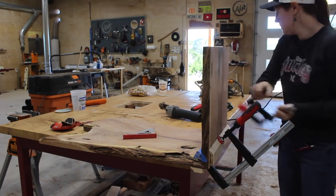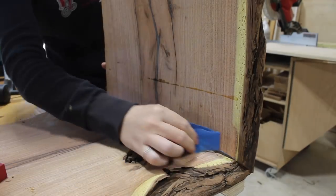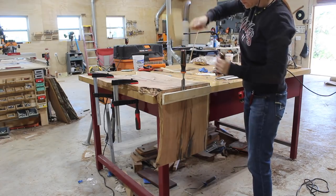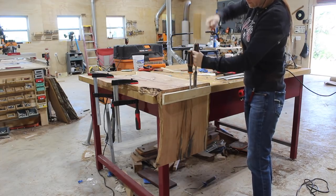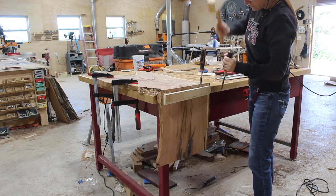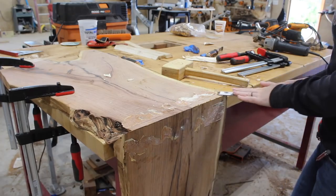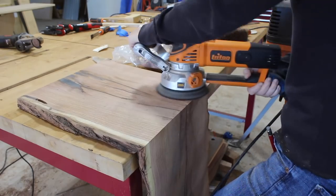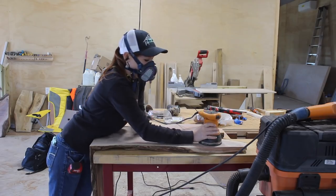After letting that set up overnight I took off all the clamps and started cleanup. First removing the tape from the inside 90-degree angle, then clamping down the workpiece to start removing those plywood cauls. One reason for making them plywood is so you can shear down one of the layers. I found it works best to use two chisels and work down the length of the plywood until the entire piece pops off. It was suggested that laying down construction paper or parchment paper between the caul and the slab makes removal even easier. I used the chisel for bulk waste then came back with a sander to completely clean it up.